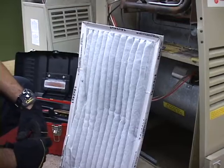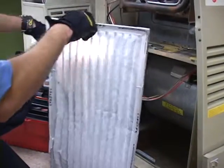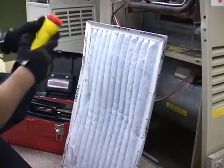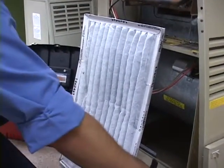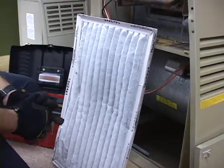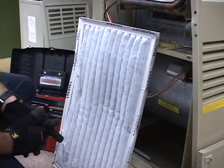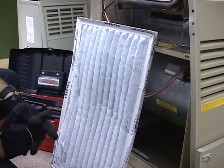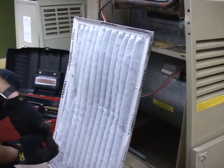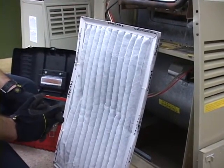When the customer does a monthly inspection, if they do the light check just like we did, or even just by eyeballing it — if it looks dirty and they think it needs changing, they want to go ahead and change it. A dirty filter is going to lead to excessive energy use on the appliance — it'll use more gas or more electricity. A super dirty filter can actually lead to the furnace shutting down on its own as a safety measure.